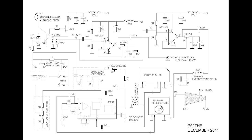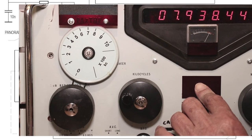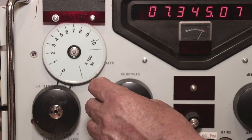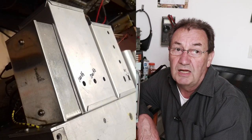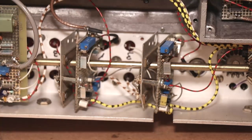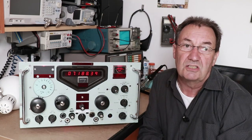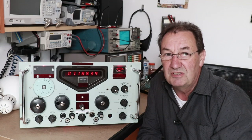To tune quickly with the kilocycles you can also use this knob — when you push it there's an extra potentiometer to go very quickly from the upper to the lower frequencies, and when you're almost there you release it and fine-adjust with the kilocycles dial. I used the original 100kHz IF with only a few adjustments for semiconductors. Right in front of the last IF there is a second tunable pre-selection stage, and together this forms the last stage of the receiver, making it very sensitive indeed.